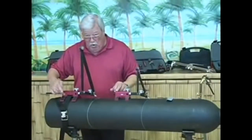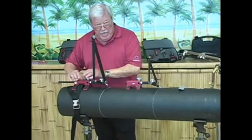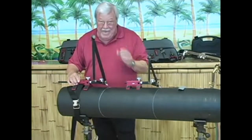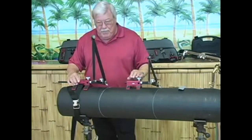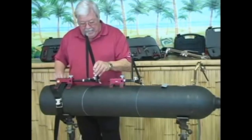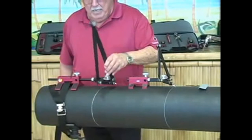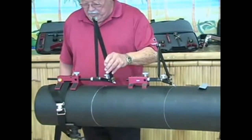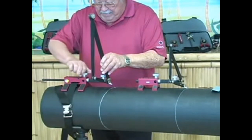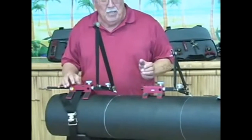On the sides, you have a quartering vial, you have your horizontal, so that when you do level the top, both these tools are in dead center. You don't have to have a center line. The unique part of these tools is I put the marking arm on its own telescoping and rotating 360 degree shaft. And guys, that opens up a whole new world when it comes to marking pipe. Or structural beams too, as far as that goes.